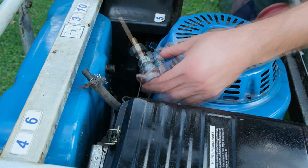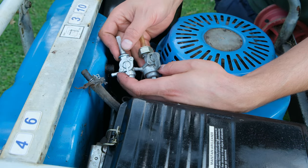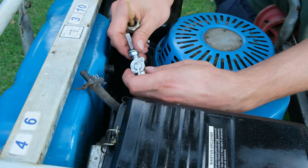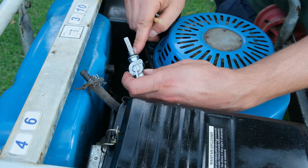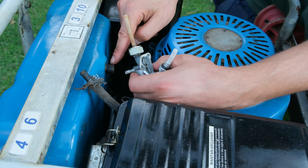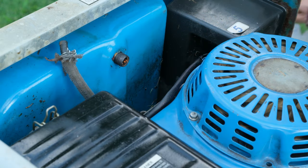There are different types of fuel tap, so make sure you get the right replacement. For example, this one uses a lock nut, with threads all the way that thread into the tank side, while this other one uses a holding nut. I'll just need to put some PTFE tape on the threads.